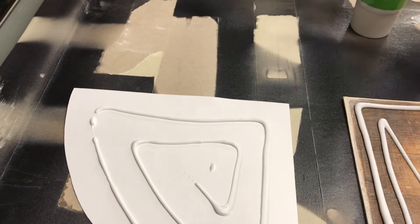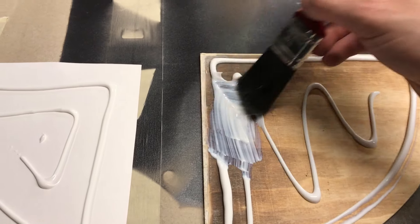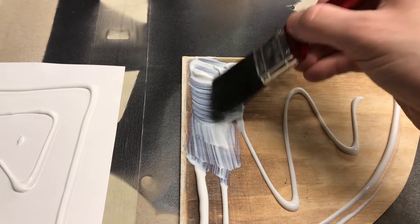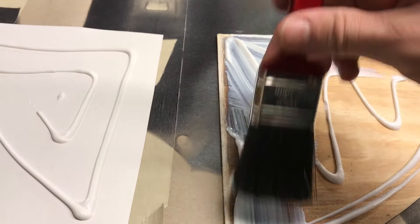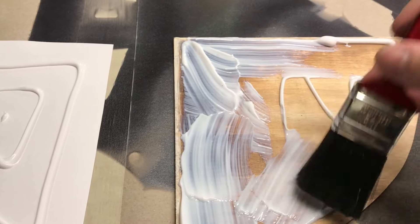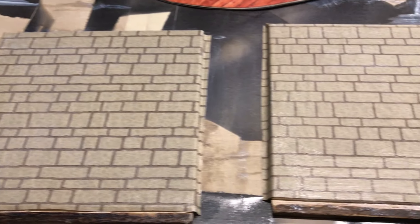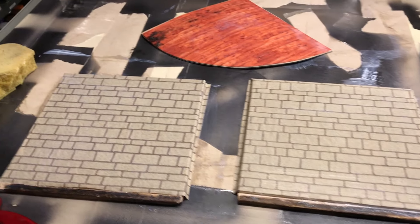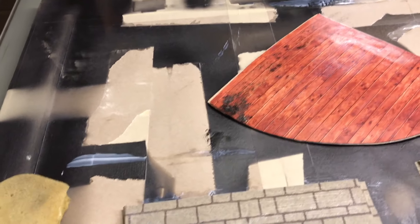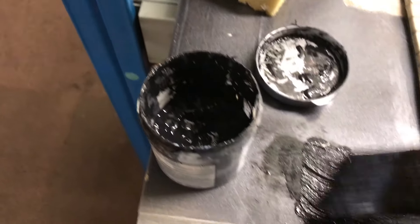So it's just this Home Base ready-mixed border glue — it's very good, it holds on well and hasn't tried to peel. You want to just take a brush — get an old brush if you need to — make sure there are no brush ends falling off into the parts, because if they do they'll show underneath. Spread it evenly and then just push them down. Use a sponge to push it out as we did in the other video so that it's all down and glued. I just applied a little bit of glue over the top as well.